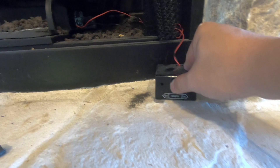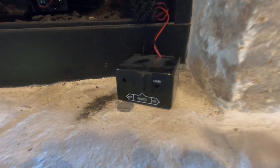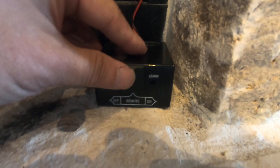Well, it doesn't work, so let me check the batteries. I got the batteries replaced. I prefer to use rechargeable batteries because they don't corrode. Alkaline batteries tend to corrode, especially if you keep them there for a year unused — they give out acid and start messing up your electronics. Use rechargeable; I use EBL batteries and I'll put the link in the description.